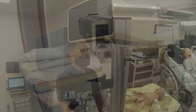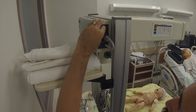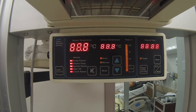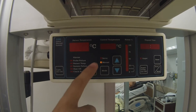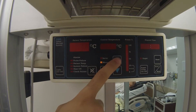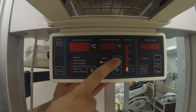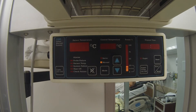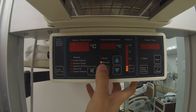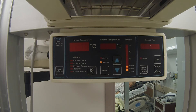VATCOAT is the only oxygen surface lubricant recommended. Turn the unit on using the power toggle switch and the unit will perform a self-check upon activation. If the unit's lights and alarms sound for longer than 4 seconds, servicing may be needed. The IWS will default into the manual mode setting with an alarm tone chiming. Select a power setting with the up or down touch switches. The first 4 steps of the power levels will engage the preheat setting. Allow approximately 5 minutes for the unit to preheat before placing an infant onto the bed.